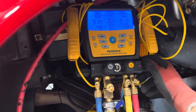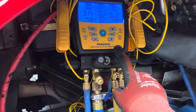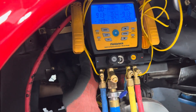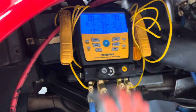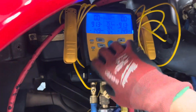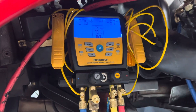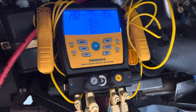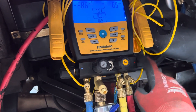I'm just waiting for it to go down and down. We're at zero now, so I'm going to close where we're bleeding it out. Now this is closed, the vacuum is still closed, the high side is closed, the low side is open. I'm going to open up the vacuum and we're going to vacuum from the low side, not the high side — continuing this flushing motion. You can see how much lower it is here than what it's reading on the high side — it has to catch up. I'll do this until it's below 500 microns.